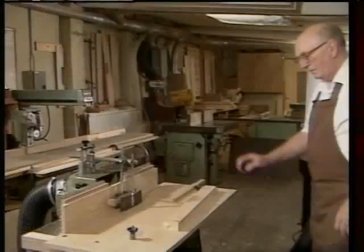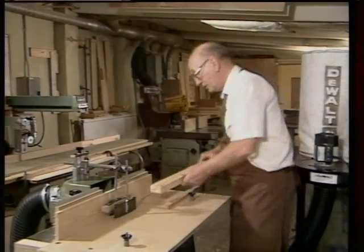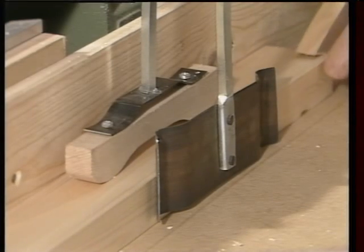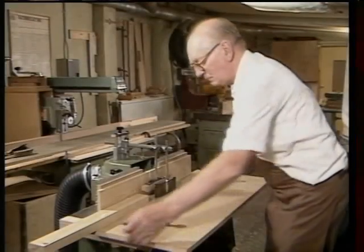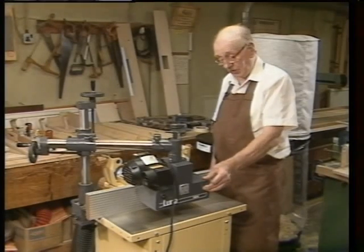essential. One of the commonest jobs with the spindle moulder is the machining of straight lengths of material. Where fairly large sections are involved, the maker's guards are adequate. A very useful addition to the spindle moulder, when long runs are envisaged, is the auto feed. It reduces operator fatigue and makes for greater safety and gives a much smoother finish.